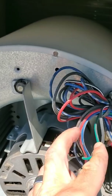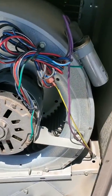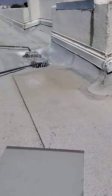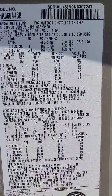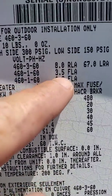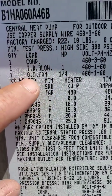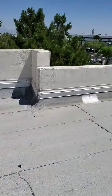That's your indoor blower - do the same thing, take amps on the wires. On this one it would be the blue, the black, and the red. Check it and make sure your amps look pretty good. You can look on the nameplate right here - it'll tell you what your indoor blower amps are supposed to be. Indoor ID blower: you're supposed to read 3.5 amps. And the bottom one is OD - that's your outdoor fan, which is your condenser fan. Do the same thing on that one too, check amps.